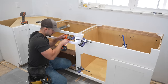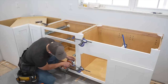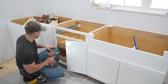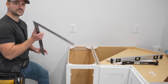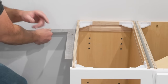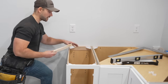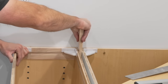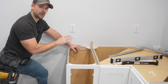Several clamp types work for cabinet installation — quick grips are preferred for speed. When installing, check that cabinets are square off the wall. If there's a gap on one side, shim the back of the cabinet from behind to push it over to where it needs to sit. Sometimes cabinets are a little twisted and you have to do this to get them sitting perfectly square.